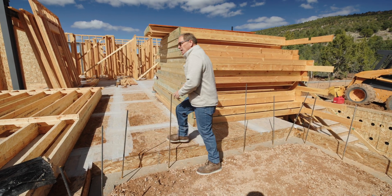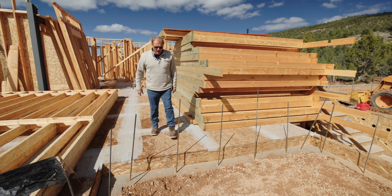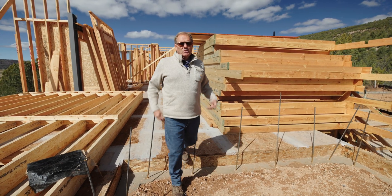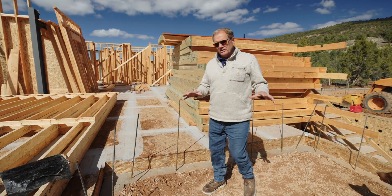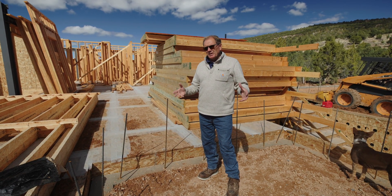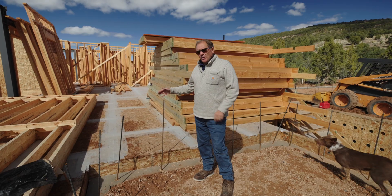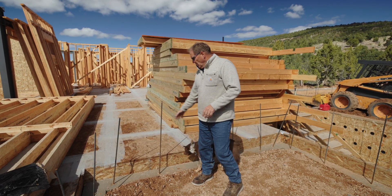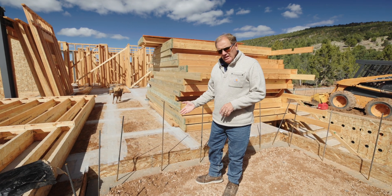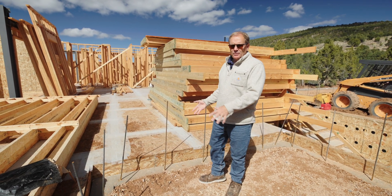I've seen jobs where I've been in the main living area of a home, and I walk on it and feel a hump. What's that hump? It's because they probably poured the slab first before the frame structure. So if you're doing this kind of complex situation, try to frame first. We will do some bituthane along there, cover it up — a nice almost 10-inch turn-down so I've got a real strong footing.